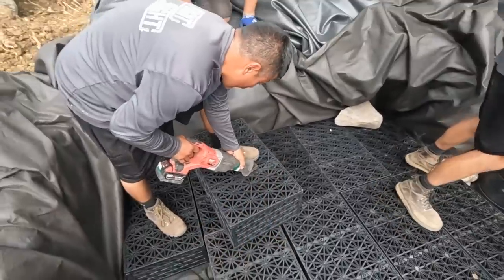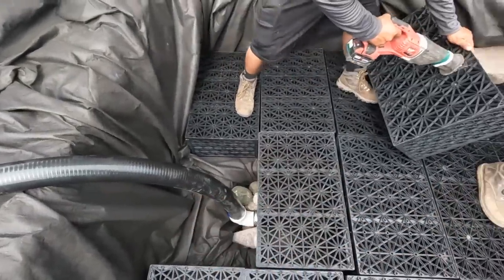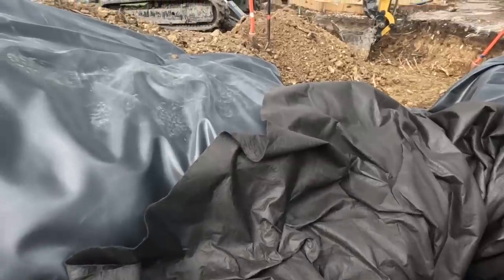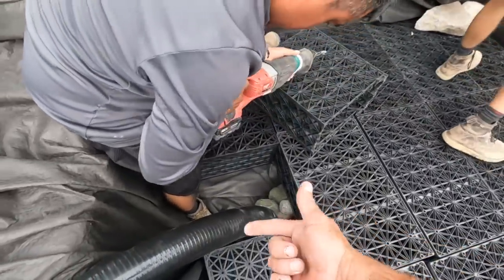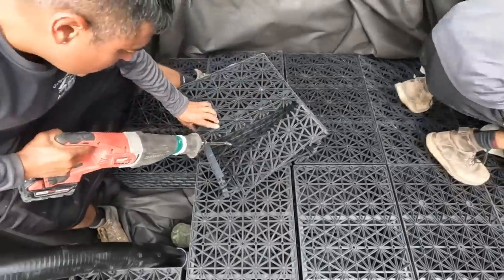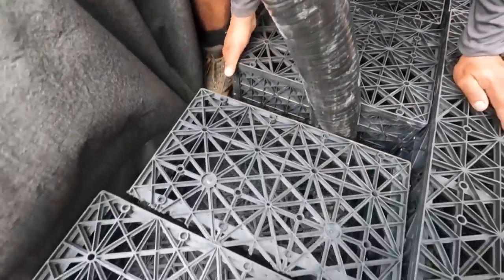Juan's going to cut one of our small aqua blocks into thirds and place a piece right there and fill between with some cobbles. That pipe coming up is the pipe running from our SLD 2-5 that will sit over in the intake area. It will be fed by a two-inch line, but it's a three-inch intake down at the bottom of the snorkel. So we're going to run three inch and then end up running two inch, tying it in somewhere up here. You can see how he put that third of an aqua block on this side of the pipe, and then we'll just fill around with gravel and cobbles to lock everything together nice and tight.